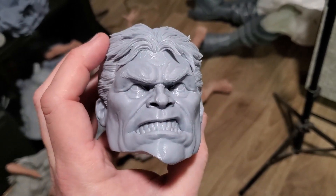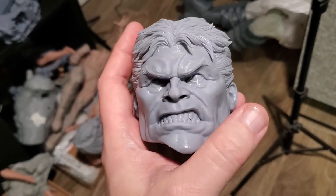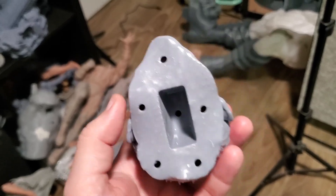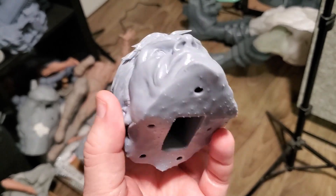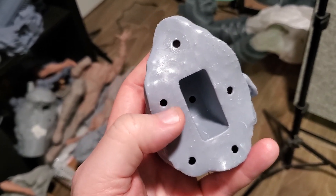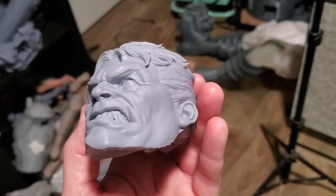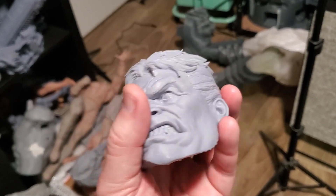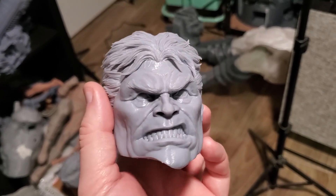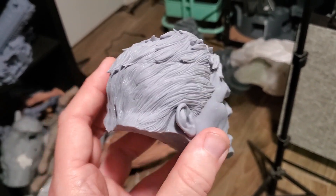Another thing I've heard people doing is using compressed air — sticking the nozzle in one side and blowing out the excess resin or alcohol from the other end. If you do anything like that, make sure you use proper PPE, wear glasses and gloves, because that stuff can splatter all over you. A lot of people ask how to cure the inside of a print. If you print at 1.5 to 1.8 millimeter wall thickness, it actually cures all the way through because the walls are thin enough. However, if you print thicker than about 2 millimeters, you should find a way to cure the inside — you can run UV LEDs up inside, or make a 10 millimeter hole and use a pin light to help cure it.